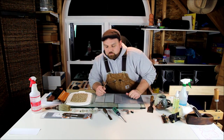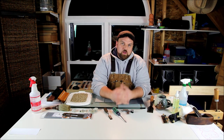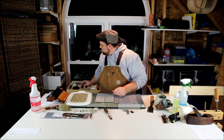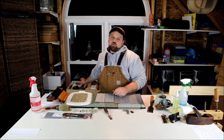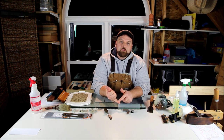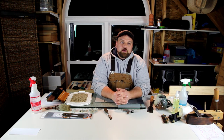So that's the reason for sharpening. This video I've chosen to dedicate to the next step from sharpening, which is honing. A lot of woodworkers in particular tend to leave honing out of their sharpening steps, which I feel is a big mistake. For everybody from your basic cabinet maker, to wood turners, to wood carvers, honing is an important step which provides you with a tool that is just that much more sharp, with an edge that's more durable and lasts a little bit longer.